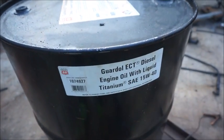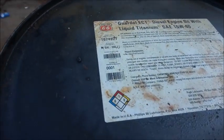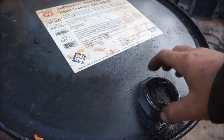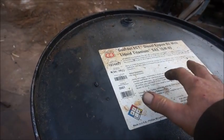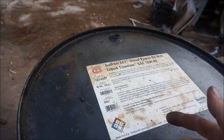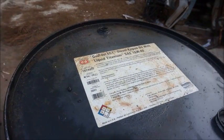First thing is to pull these caps out. It says 'liquid titanium' — I hope that's not flammable. No classified hazards, but that doesn't mean it won't burn. I'll take these caps out, then burn a hole in the center here and weld a pipe in that sticks down three or four inches — however thick the bottom of the smelter will be, since this is the bottom side. This is actually going to be our drain in case something happens to the crucible and it melts, so the molten metal flows out the bottom.